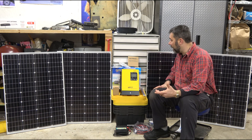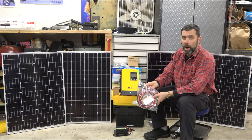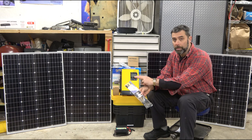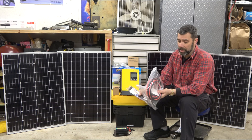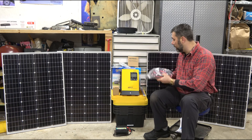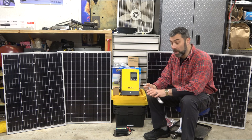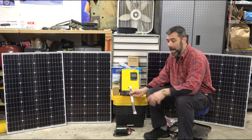Some other equipment I had to pick up to make this work: these are the wiring runs that link panels together. These are splitter-combiners — you take two panels and combine them to get 24 volts instead of 12. Then there are cables that run from the panels down to the charge controller box right here. From this, I'll cut one end and wire it into the charge controller, and it will also go to the actual battery bank.